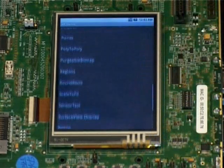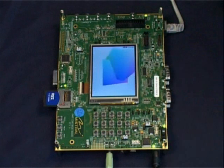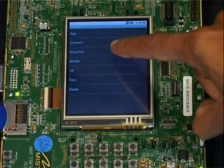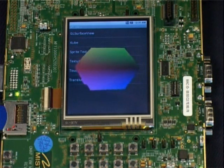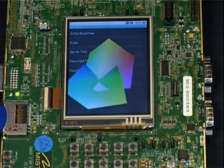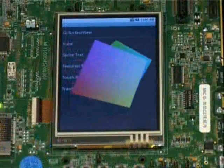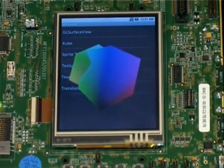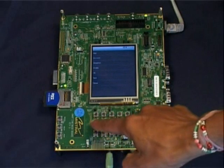Android supports OpenGL 1.0 for embedded systems, and some of these demos show this capability. This is the GL surface view — the same data is represented in different graphical forms in the cube view and the translucent GL surface view. The translucent view gives an overlay of the surface view with the menu visible in the background to give a translucent effect. We can see that the rendering of the 3D graphics is very smooth and without any breaks in video. This is because of the powerful ARM Cortex core on the OMAP3530. This performance will be enhanced once the OpenGL 3D graphics hardware accelerator core of the OMAP3530 is enabled.